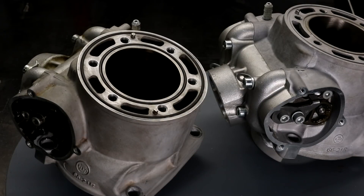Some of the key things to reduce wear on the cylinder include maintaining your air filter — clean them regularly, make sure they're thorough, and seal the airbox correctly. If any dirt gets into the cylinder it's going to cause wear very quickly. Also two-stroke oil: there are many different types, so choose a good one and make sure you mix it at the recommended ratio. I use Motorex Cross Power 2T mixed at 60 to 1 and get very good results with that.